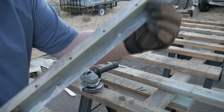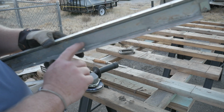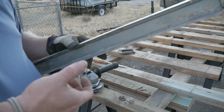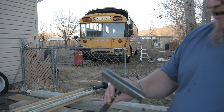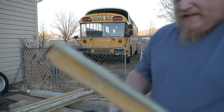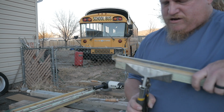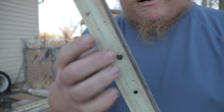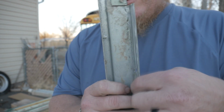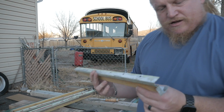So now the inside is all adhesive free. I do have these little raised sections around these old rivet holes that I'm going to take my hand seamers and just use to flatten these back out. These are just 6-inch hand seamers, and I'm just going to use these to flatten out that old rivet hole and the other ones like it that are protruding on the inside. It's kind of hard to show, but they have a little bit of a raise, and so this gets rid of that. So when we go to re-rivet this, it's not deformed.